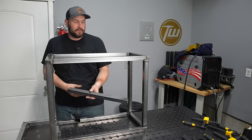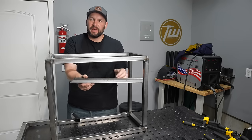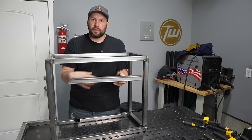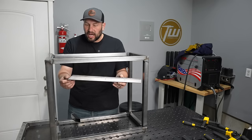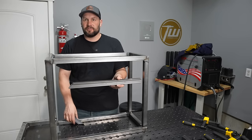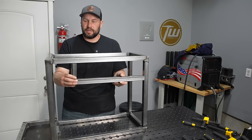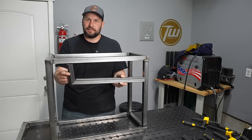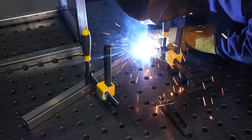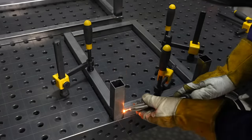Next let's build the shelf for the foot pedal and welding consumables. I kind of messed this up — I was planning to run a piece of tubing about four inches down to give me a shelf and a place to attach my hooks for my cables, where they wouldn't be in the way of opening the door to service the wire. However I cut my pieces in the wrong order and didn't leave myself with two pieces long enough. So I'm going to change the design a little bit to put an angle right here with two parts — I think it'll actually work out even better. Rather than putting the tubing in one piece at a time, I'm going to build it into a small sub-assembly starting with two angle brackets, then put those together to form the whole shelf assembly and tack everything together before putting it up in place.